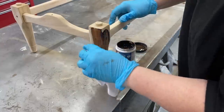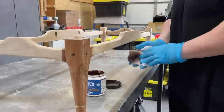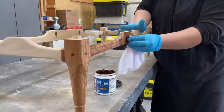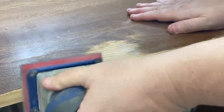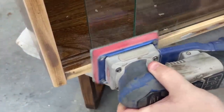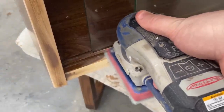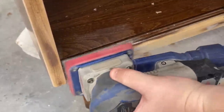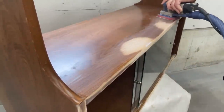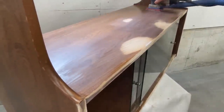This is pretty close to the original finish — I was kind of impressed with myself. I think it's just a tiny bit lighter, but I love the way that it turned out. By the time I was done with my stain, the filler was dry and it sanded out much better. I used that same 180 grit sandpaper to buff out any dents or scratches and then scuffed up the rest of the old finish just to give the surface a little bit of texture and grip.